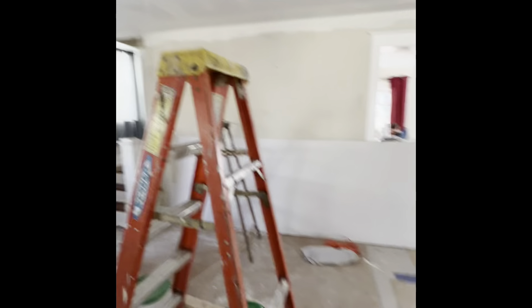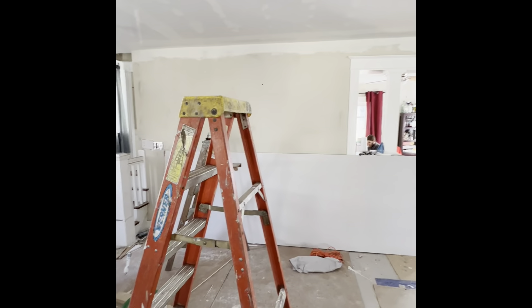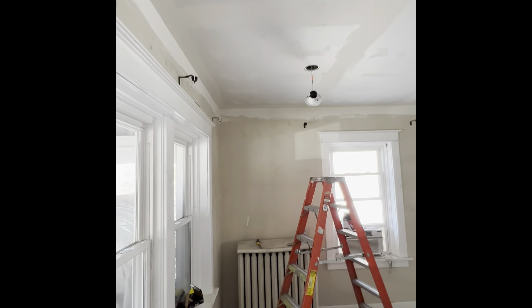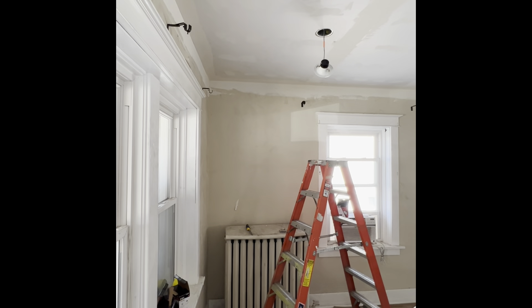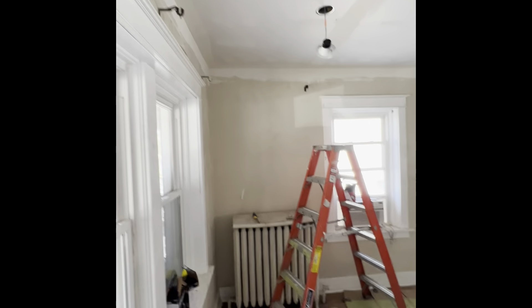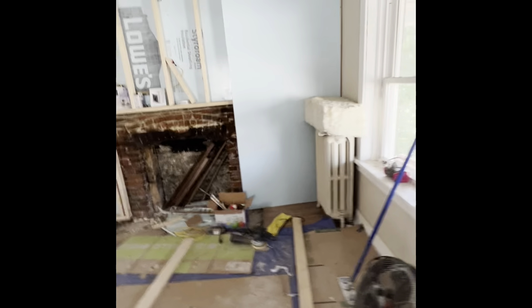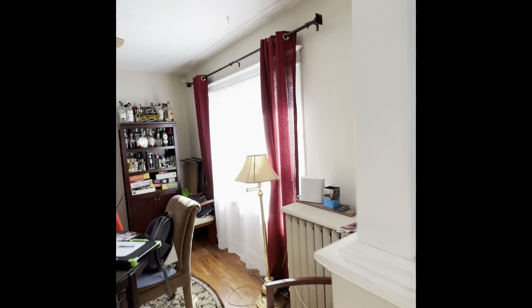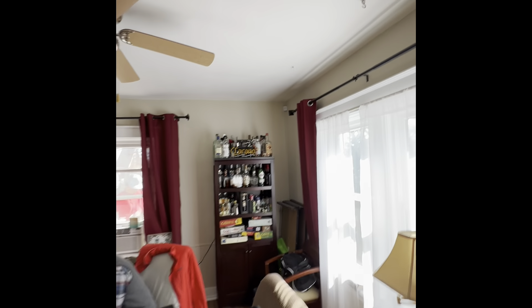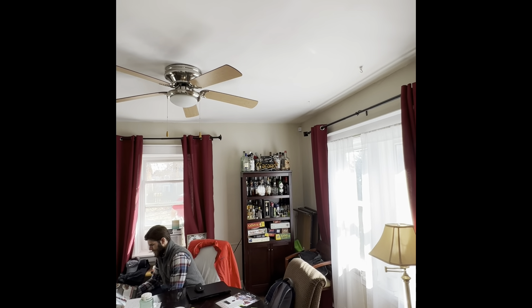Entry door coming in — got a radiator for heating. We're looking at a mini-split head over here, with our head above this radiator on the left side of the home when facing it. Our two upstairs units would be on the left side of the home as well, coming out the outside. We're restricted on this side with windows and the chimney. And then for our second head downstairs, in the dining area — that back corner wall. This wall is eventually coming down where it's attached to the kitchen.